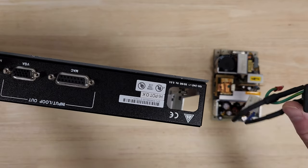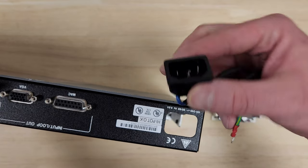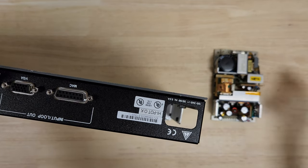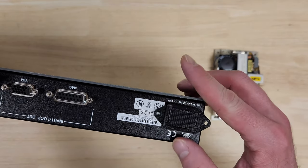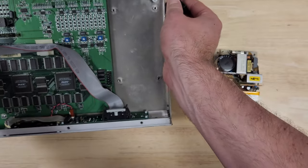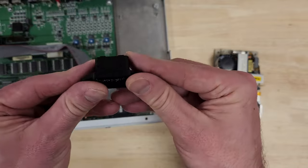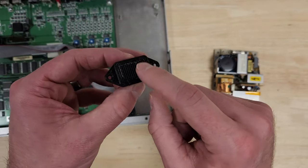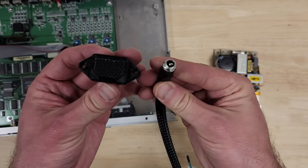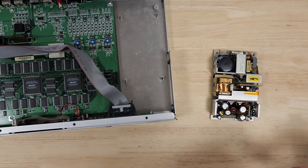For the power input, the original was a clever little thing with clips on the inside - you push it in and it clips itself. The closest I could find to 3D print was something like this. I did manage to fill it in so I'm somewhat proud of that. We'll do a hole here and a hole there, which will allow the barrel jack to come out and mount flush onto the hole.